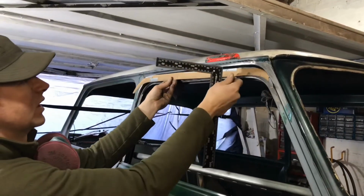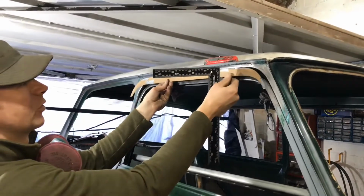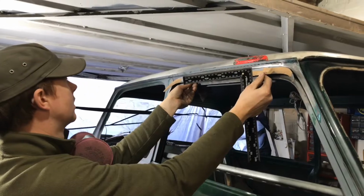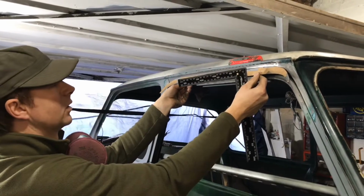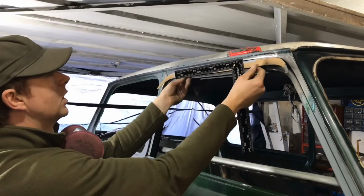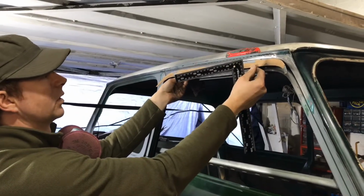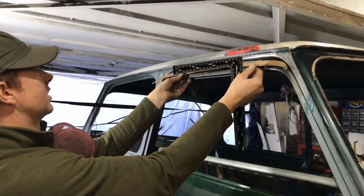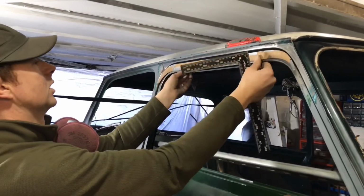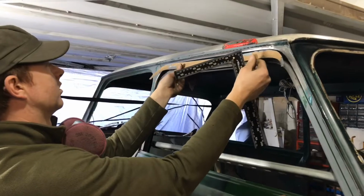So we laid that cardboard back on, and then just basically the saw just pressed into it with the head of the panel beating hammer. Just put a bit of lead on the head and just pressed into it so we get the profile or the right shape of the door. But it's a bit deep. That's where we are. As you can see, when that's laid on, it's hard to do this, but when that's laid on there, you kind of see it's a bit too much.